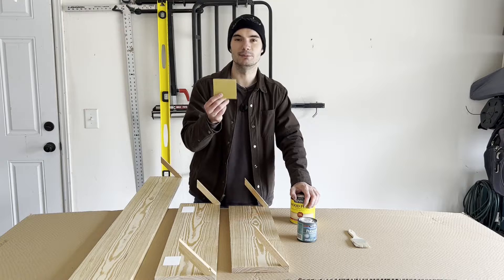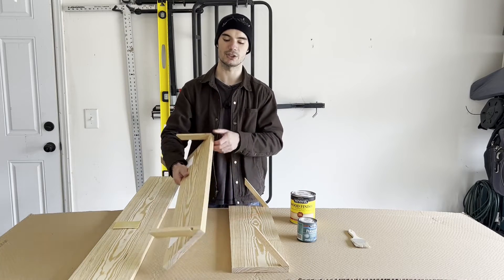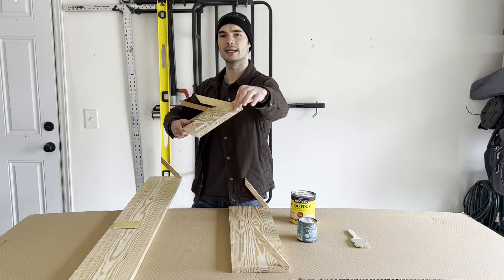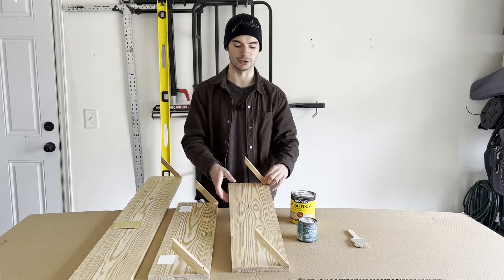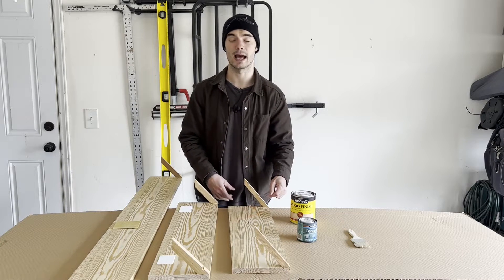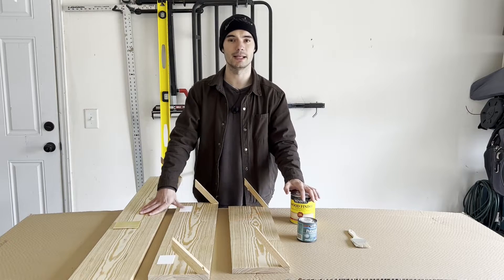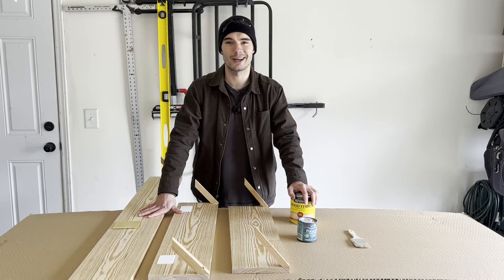So the first thing I'm going to do is take some 220 grit sandpaper and just sand all this down to get a nice smooth finish. We've got some rough edges here that I'll probably get a splinter on, and then we've got some glue residue — you want to make sure you get rid of that because stain is not going to absorb into glue. I've also got this weird orange, kind of waxy paint mark that I want to get rid of. We're going to sand it down, do a quick stain, do a time-lapse of all that so you can see the color change, and then show you the after shot.